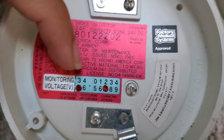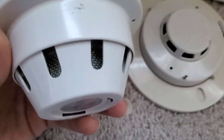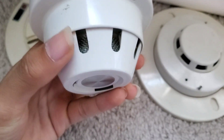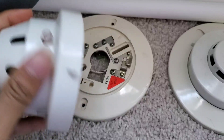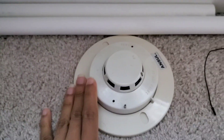Right here, if you look at the front, it says 'contains radioactive material.' So in here there's radioactive material. Unfortunately I can't really access the smoke chamber where the smoke particles enter. But once the smoke particles enter this chamber, there will be a reaction with the radioactive material, and once that reaches a certain point it will set this detector off. It will short the zone — short the wires on the zone that this detector is on — and that will initiate a fire alarm on the main control panel. That's about it for this detector since I can't access the chamber.